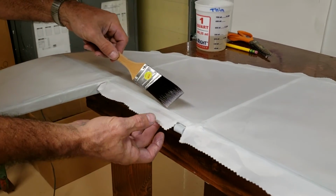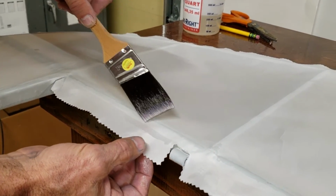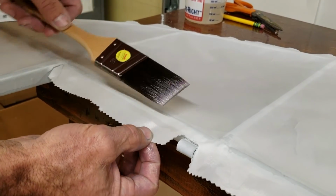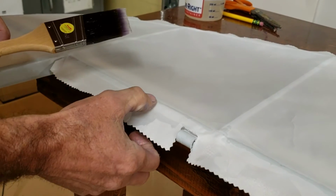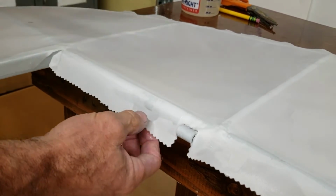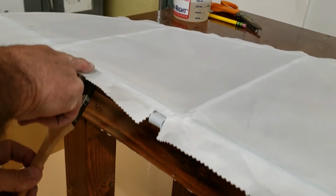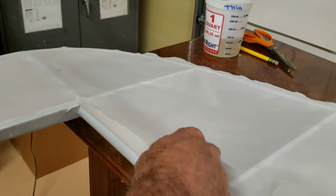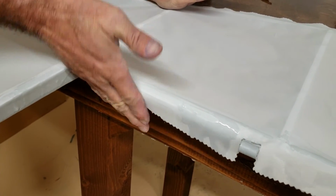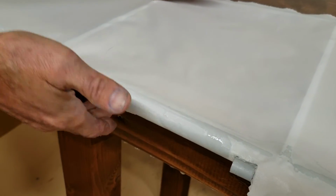Now, remember a while ago when I told you, see how that white line looks right there? When I was wetting that down, now I got some glue right there in the fabric. The glue is not going through that already glued side. When I wet it down, there's actually going to be a little spot there that you're really going to have to rub and rub and reactivate that glue till you start seeing through it to come down. That's usually in those situations where you've got a little glue on that edge. That's why I take that brush all the way up into that other spot and wet that side down again. You can let it set for just a little bit, and then it's dry. There isn't enough on it to come all the way through on your hand. And you will eventually get a little glue on your hand. At the end of the day, take a little reducer and clean your hands up.